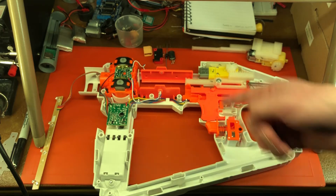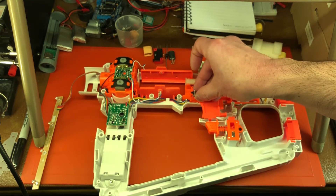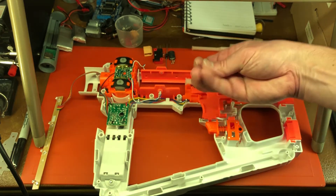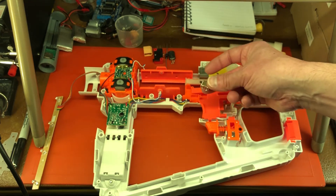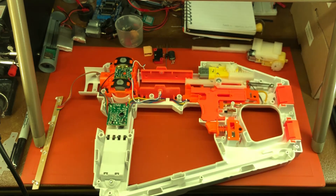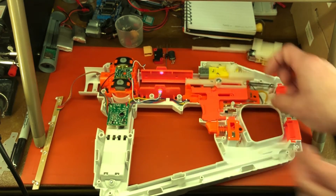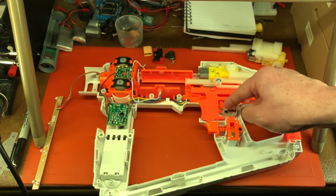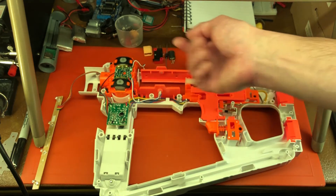This switch used to be the magazine lock switch. In addition to removing the mechanical parts for the magazine lock, there was this additional electrical switch — all you do is take the two leads, cut them off, put a little shrink tubing on there, solder those leads together, and seal up the shrink tubing. That acts as a bypass for the switch. We now have this extra switch, which conveniently fits right in here — this is how we activate the fire switch to turn on the pusher motor. We need to incorporate this into the circuit so it can only be activated when the rev switch is depressed, which prevents activating the pusher motor when the flywheels are not running and causing a jam.